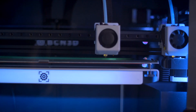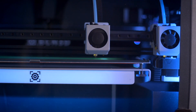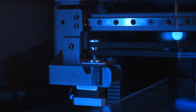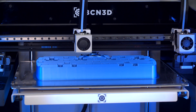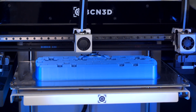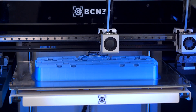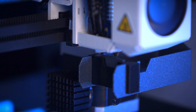A signature feature of every BCN3D printer is that there are two printheads, not just one. IDEX, or Independent Dual Extrusion, has two fully-featured printheads that ride along the stainless steel crossbar, each with their own dedicated motor driving their X-axis movements. Instead of a dual-extrusion system with both nozzles on one printhead, IDEX allows the unused hotend to park off to the side, cool down, and stay out of the way until called upon — at which point it purges into a purge bucket, wipes off the nozzle, and resumes printing. This entire process keeps the in-progress 3D print clean and free from any oozing or smearing from the unused nozzle.